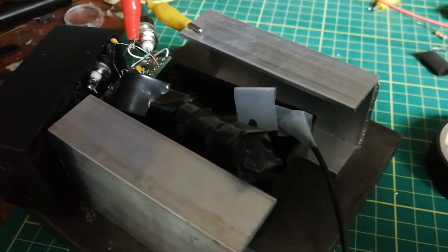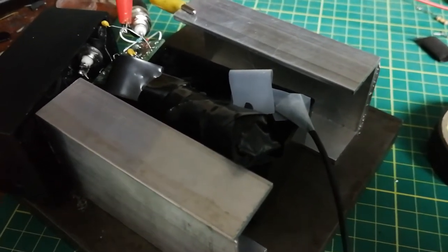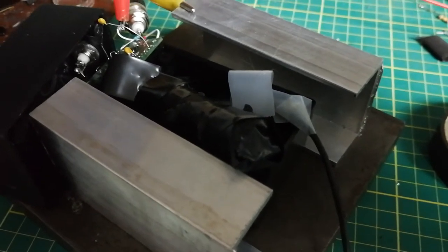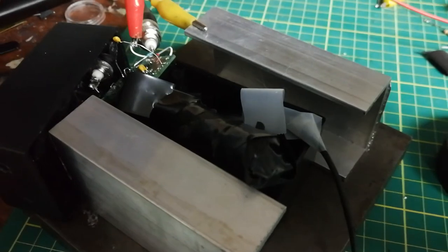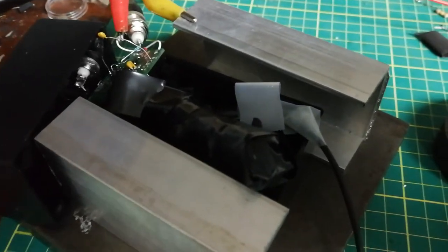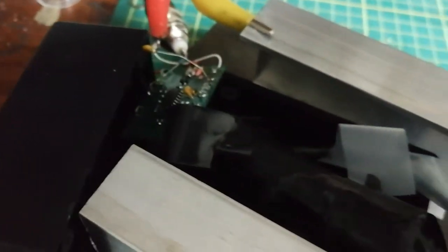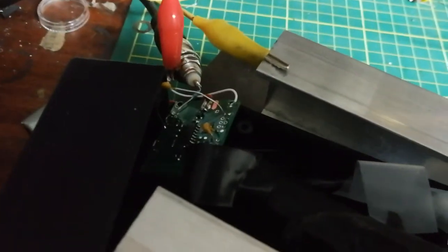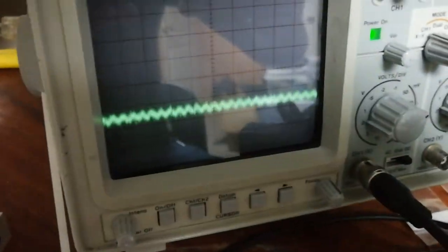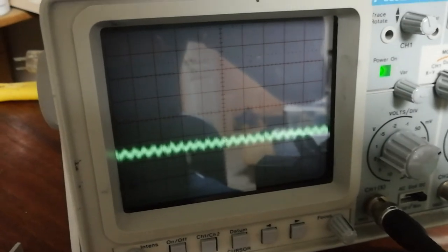It's not really the greatest material to lightproof things. And so I spent all night chasing light leaks by shining little LEDs on different parts of the tubes and trying to put a piece of tape over it. And that was a huge pain, but I did get down into the photon counting region finally. So just quick notes on the setup. My fastest quad op amp into BNC up to the scope. And you can see some lab electrical noise and also the noise floor of the amplifier if you look carefully.